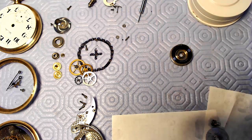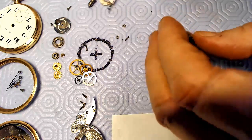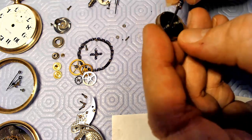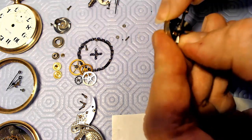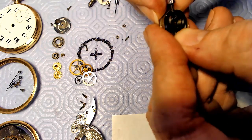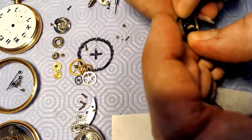Now, doing it with finger cots on is usually a disaster. So I'm going to take the finger cots off. So you get the play-by-play, you get the I'm going to's all the time. Then you've got to put your fingers in here as you walk the mainspring out, and try not to get it snapped into your eyeballs.